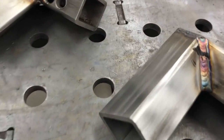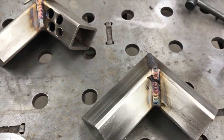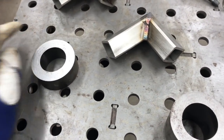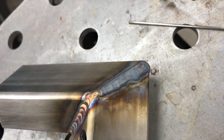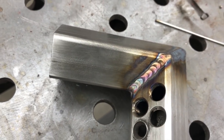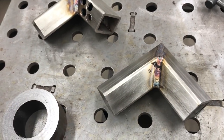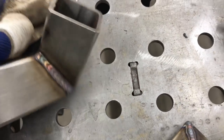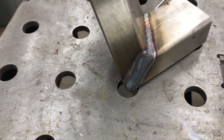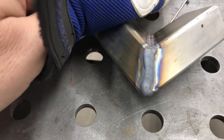So a little bit of test welding there, and I think I touched that with my glove and got a black smudge on it. I was going to show this and see what you guys think. On the outside corner joints — especially like this one here — see how it's sort of grayed over? And then on the inside joints it's really bright looking and well defined. On the outside joints, you can see the same thing — just more grayed over.